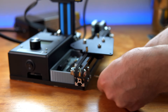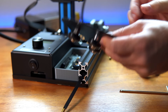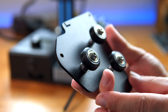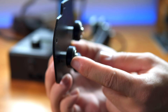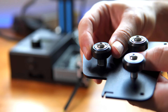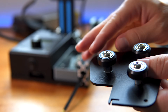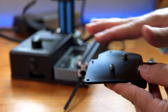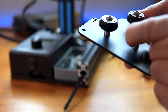What I want to do is completely take it off this rail. So we're just going to loosen this tensioner, pop the belt off, and pull the tensioner completely out. It appears that this single wheel here is somewhat worn out — there are filings on the inside, and it looks like the wheel is being worn out by the channel. It could be a millimeter or more on each end by the time you put the plate on.